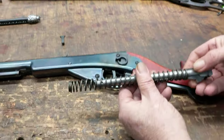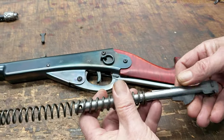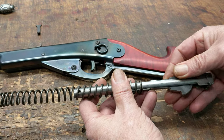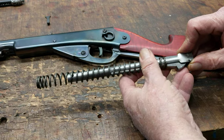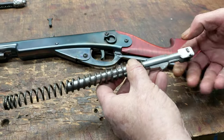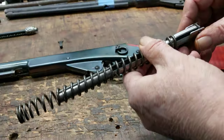To refresh the viewership, a sliding spring block is a small metal tab. It can look like that — it can look different from this. But its essential function is to provide a bearing surface for the lever to push the main spring into battery. The main spring pushes it forward, of course it compacts, then the sears release, the gun fires. That's how a sliding spring block works.